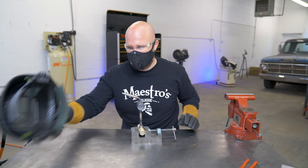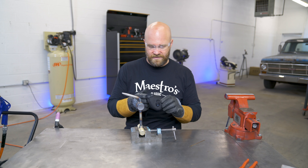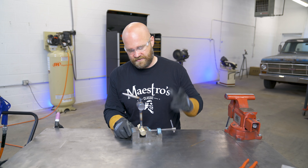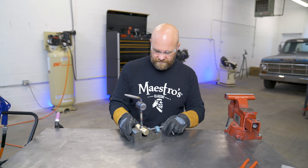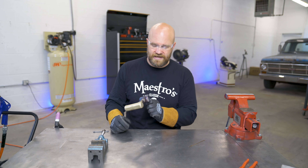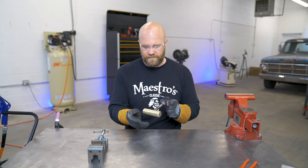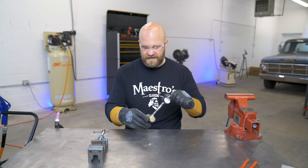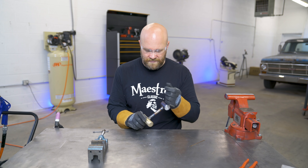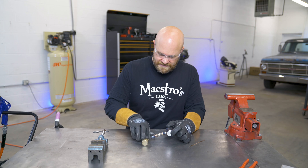It's not the prettiest. Whenever you're welding brass, you're going to want to wear some kind of respirator — I don't know if this is sufficient, but it's got to be better than nothing. Brass contains zinc, stuff you don't want to breathe in, so wear a respirator — best one you have — and proper ventilation. I'm in a big room here. I need a lot more practice using silicone bronze. The 3/32 was too big — it made too big of a ball and it was really hard to get it to lay down. I did end up preheating the piece of brass a little bit. I know you don't melt the base materials, but it did seem to help it want to jump down to it, because it just kept trying to jump to the steel. A lot of things to learn from this. If you are going to build one of these and want to keep it simple, go ahead and make that piece out of steel so you can just weld both of them. But the brass does look really nice.